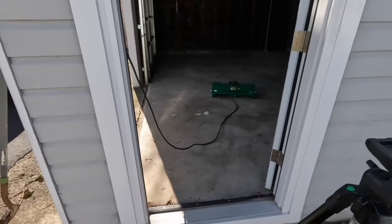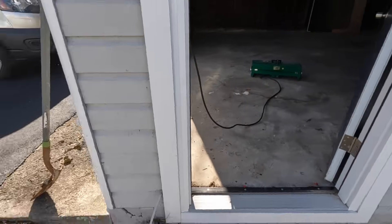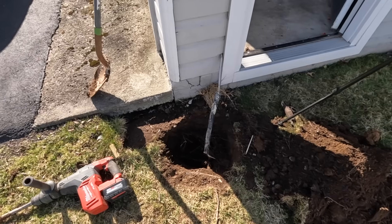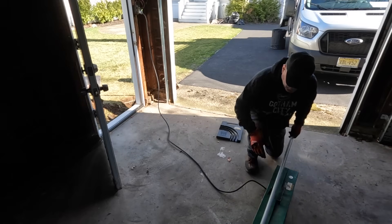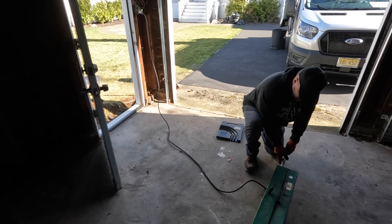I'm going to set up my PVC heater and warm up a stick of three-quarter inch PVC to get my 90-degree bend in before I disconnect this wire and put it into the hand hole. My heater's been heating for a little while, so I'm going to try to get my 90 bent here now.